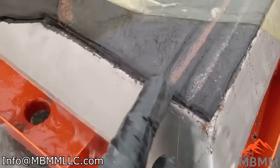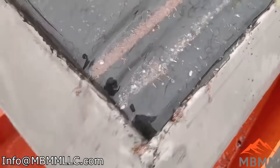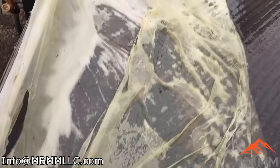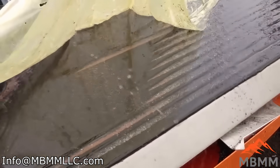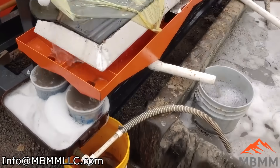You could probably even split these two — run all this into number one as clean and get a contaminated aluminum-copper cut here. Actually, there's hardly any copper in that second groove. So there might be some more fine tuning to do here, but I think if we're just throwing some plastic on the table and running the sample, it's working really, really well. Let's see what happens — you can see the copper starts to float a little bit. I'll get it wiped down and cleaned off and we'll take a look at what we got in number one, number two, and number three.